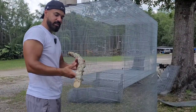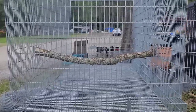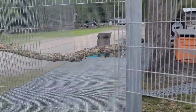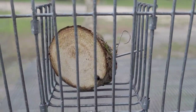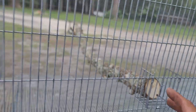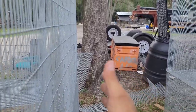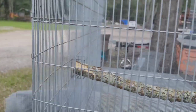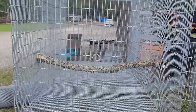The brackets are finally in place, now it's time to place the wood inside. You can see how the brackets hold the wood in place. Each one of these pieces of wood has a little nail that gets connected to the bracket so it doesn't slide out. That also helps support the side wall so it doesn't pan out — the wood in the center kind of pulls the two side walls together and keeps them straight.